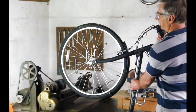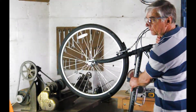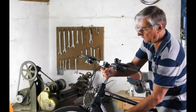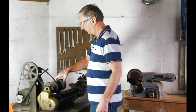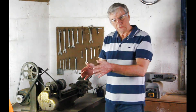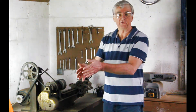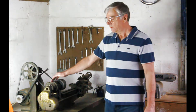Carefully — I've got my foot under the rear wheel — you can just lean or rest the bicycle wheel onto the chuck. Now it's quite easy to measure the number of revs in one minute of this wheel. Knowing the diameter of the bicycle wheel and the diameter of the chuck, that ratio of diameters lets me multiply the 52 RPM I got for my bicycle wheel, which factored up to 310 RPM on my chuck.